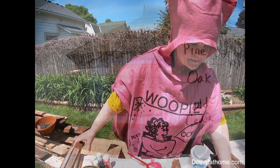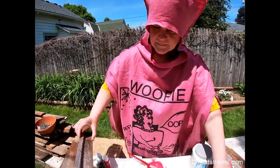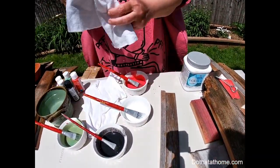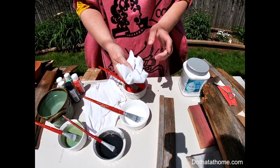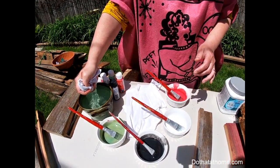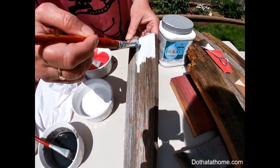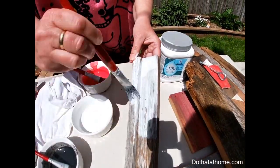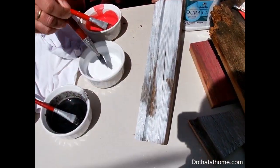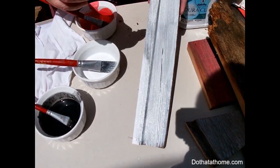We'll start with the wash. This is old wood and it's going to soak it up pretty quickly. You should also have rags nearby — white t-shirts cut into squares work great — and some water. I'm going to get my rag a little wet to help with the whitewash. Simply take your wash and get it all on the wood. You want to work quickly, especially with very old wood, to keep a wet edge.